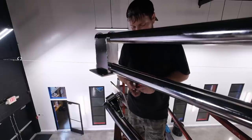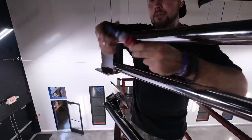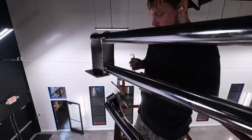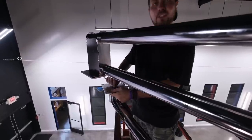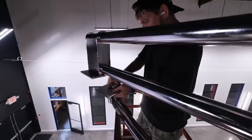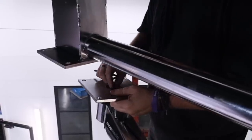The reason they have this hole on there is just for if you have a normal ceiling mount and you want to flush mount the hoses in the ceiling so you don't see them at all, which is a nice touch. Let me just thread this right in. It's important that this plug be flush with this plate though — there's no room for it to stick out. You've got to make sure it's not protruding at all. I've never done this before, but I have a feeling that I'm right. I don't want that to ever leak.